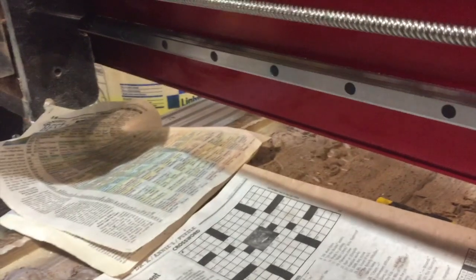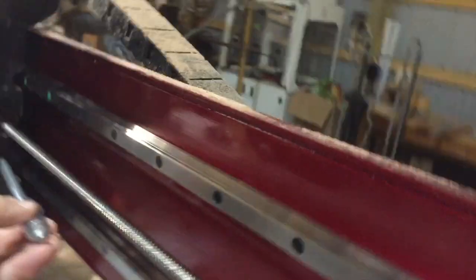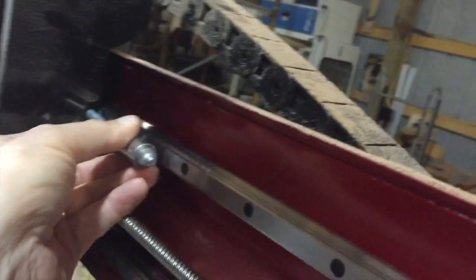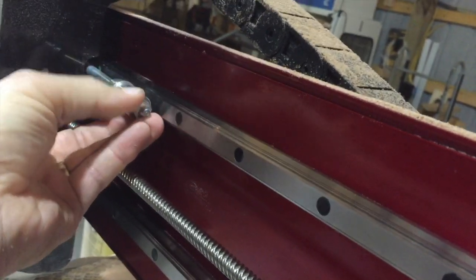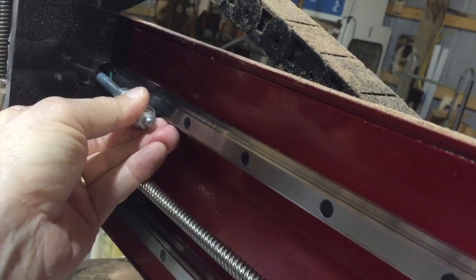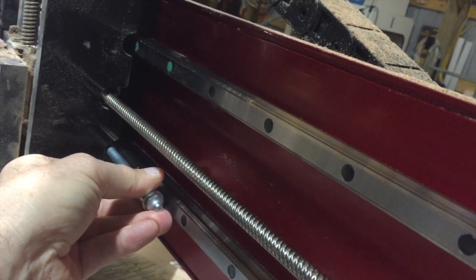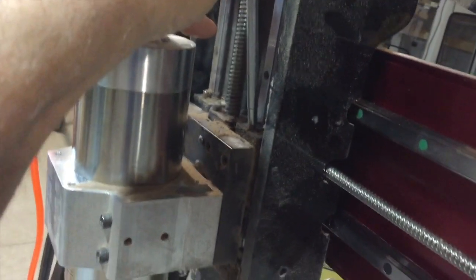After wiping, the next step is greasing. I recommend a nozzle that lets you get in and place it on top of the grease fitting, then attach your grease gun and pump. You must use NLGI 1 rated grease as specified in your owner's manual. Number 1 grease is available from Grainger, made by Mobil. Locate each fitting, lock on, and inject two to three pumps per fitting.